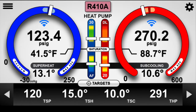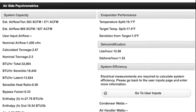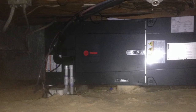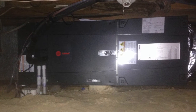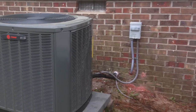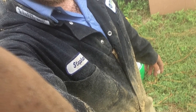The final information shows 909 CFM with a 19-degree split, with a target of 17 and a half. The air handler was pretty tight, almost floor to ceiling. We've got a condensate pump buried to the hilt — we replaced the line set and the return flex, replaced and relocated the disconnect, replaced the pad, and ran a new line for the condensation pump. It was sandy and I got sand in places I didn't know it would go.